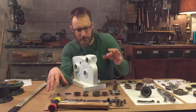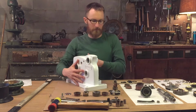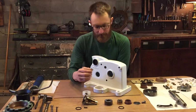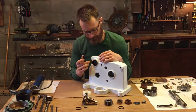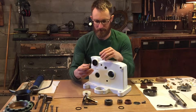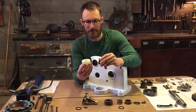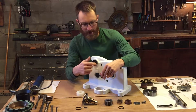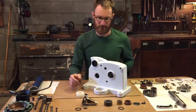Got the tools out. Here we just need the 17mm. So we'll flip this over, and as you can see, we installed the first bush. It didn't fit in as tightly as I had hoped. So what we used is some regular Teflon tape, plumber's Teflon tape. 2 passes around and it fits really tight. So we're going to do that with the next side.